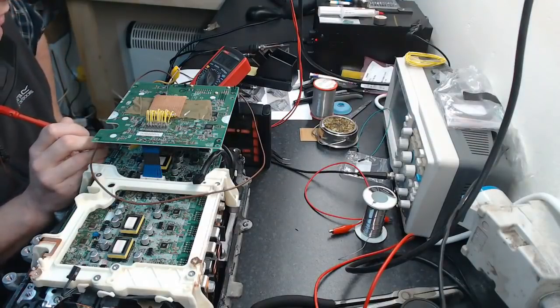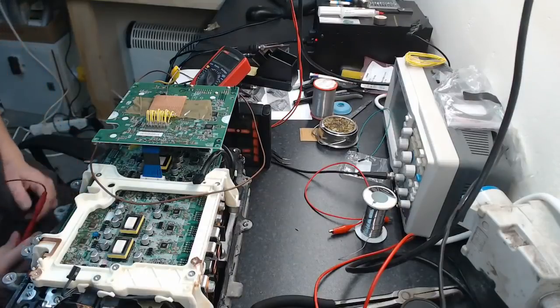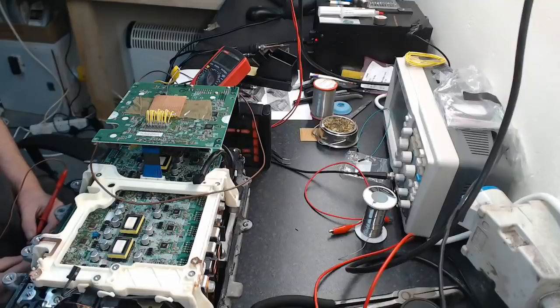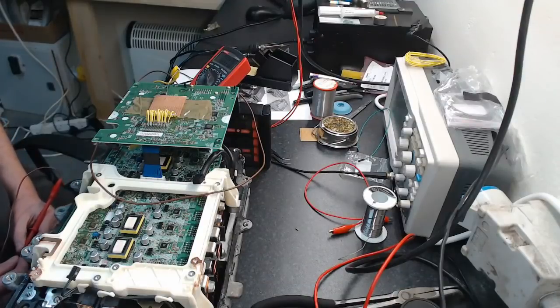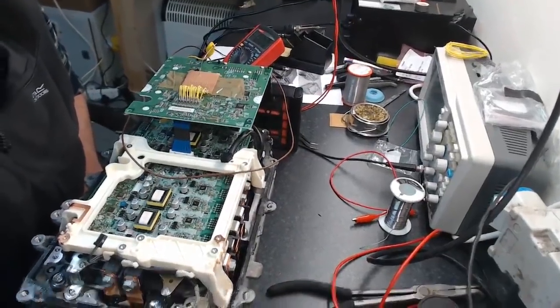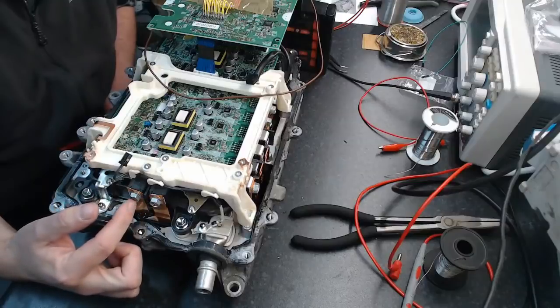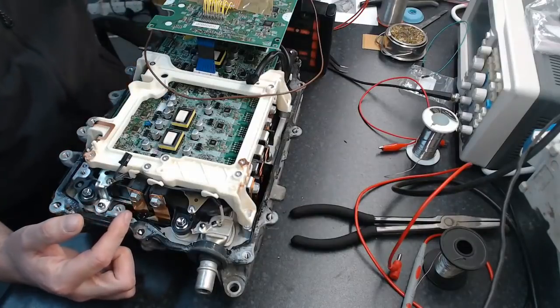That'd be really cool. Okay, so, interestingly, hang on, what am I missing here? Yeah, what am I missing? I think I've been a bit of an idiot here, guys, because what we don't know is what constitutes a high side and what constitutes a low side. What I've got to do is determine which of these terminals here on the side are which one's positive and which one's negative. Then I'll use the meter on the IGBT block, which would be a better way to know whether we have a high side or a low side turned on. So yeah, that would make better sense, I think.